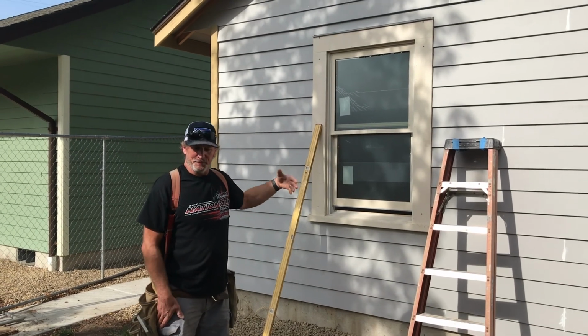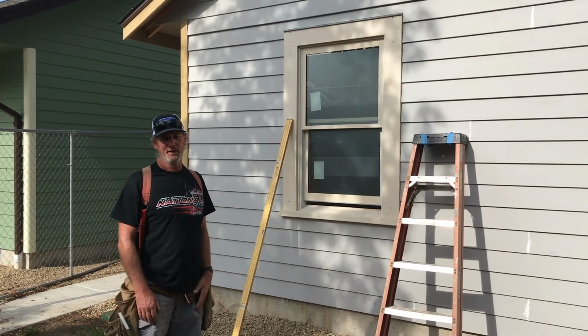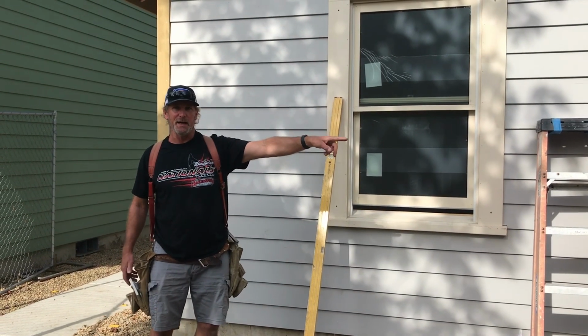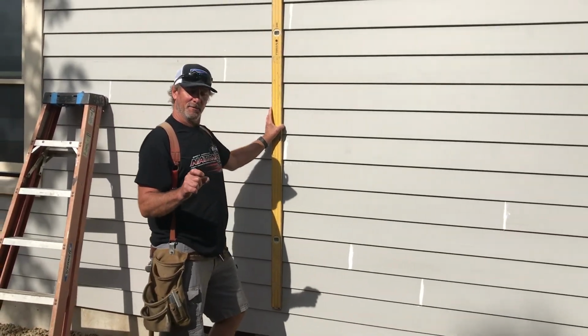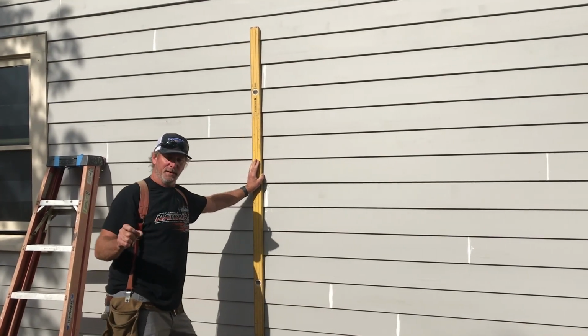This is cedar siding. I'm not satisfied that the nails on top are enough. It needs to be face nailed, which means you will see the nail. I want the nails to be in line and look real pretty and straight, because you will see them forever and ever. I'm gonna use a level. I'm gonna find layout. Wherever there's a break in the siding, those break on a stud, and I'm actually gonna put it off of the splice, probably an inch or so. And then I will make my level plumb, right like that, and I put my nails an inch away from the level.